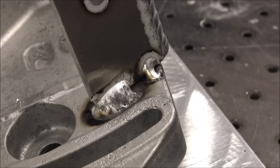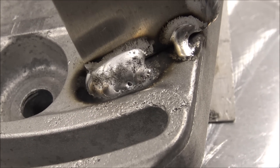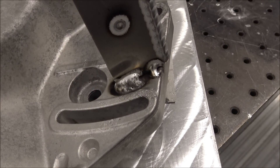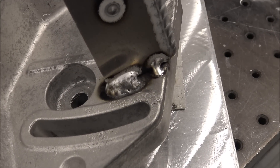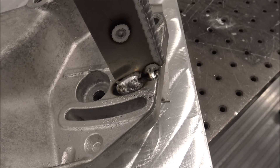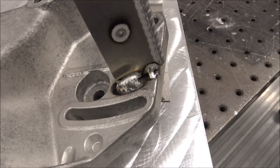I'm gonna stop right there, that's probably good enough. It probably didn't come up on camera too well, but you can see all that porosity on the bottom coming out of the part. It's not as high an aluminum content as I was hoping for — there's a lot more junk in there, like pink and green and blue flames coming out of it. When it was cooling it was pinging and crackling a lot, and that's a bad sign too.